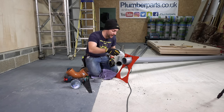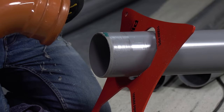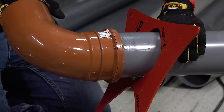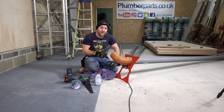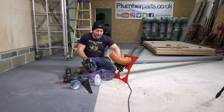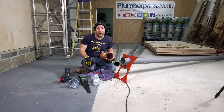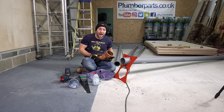The next thing I'd always say you should do anyway is add a little bit of fairy liquid or some sort of lubricant. It doesn't matter how good the chamfer is, this just helps. And also if you get a measurement wrong, it's very simple for you to pull it off and reposition. Done, boom, sorted, easy. That makes pushing together a socket for four inch or any other pipe very straightforward - we can go up to 160 millimetre pipe with this particular tool. Fairy liquid is a very, very handy thing to have.